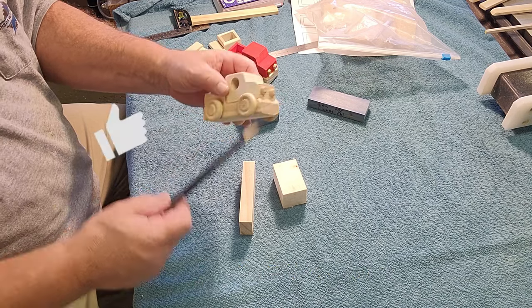So I'm going to have to move this fence a little bit, and this table, we'll just slide this table back a little bit here. We're going to cut that hole. Now, like I said, that bit's got that little point on the bottom there. I'm going to run my bit all the way down. That point goes in my table base there just a little bit, just so it touches. And I'm going to lock it in. So now my drill bit's only going to come down that far.